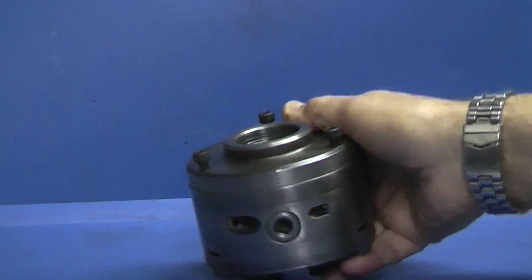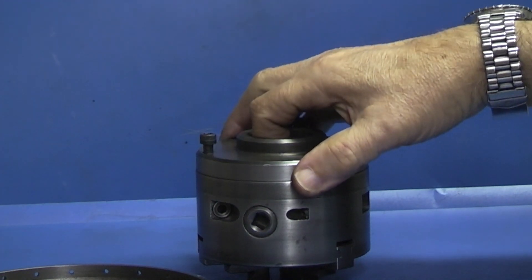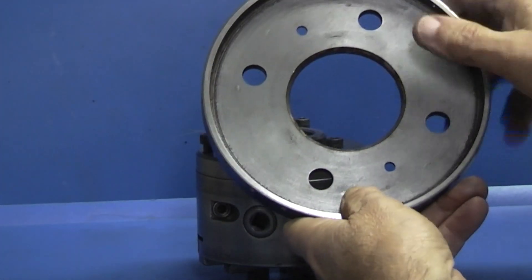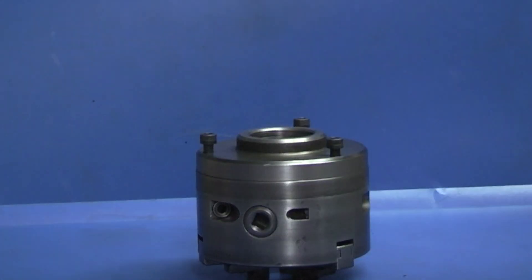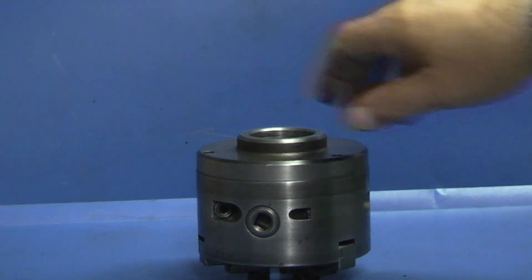The problem I have fitting it to the three-jaw chuck is it will fit over the clearance hole, will fit over the hole in the body, but I have three cap heads which hold the back plate to the chuck. So I don't want to be undoing these every time I want to fit the indexing ring. What I will do is drill out three holes in the back so that it will go over the three holes in the back plate of the chuck, and then all I need to do is drill two holes in the back of the chuck and tap them to fit the countersunk screws.